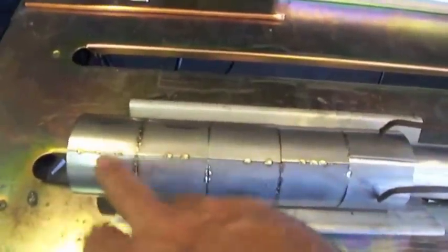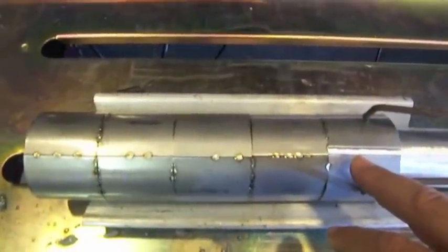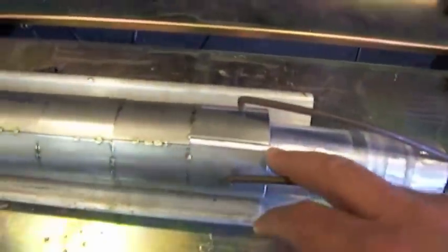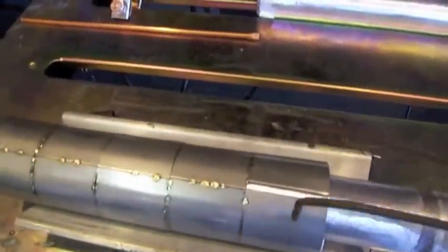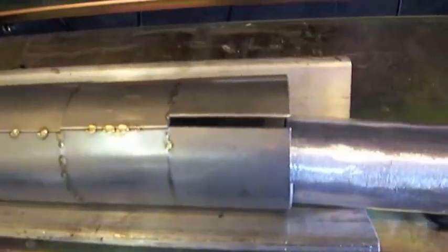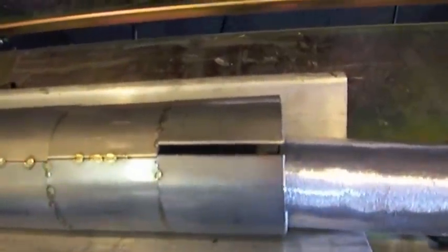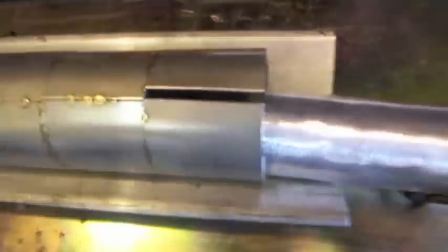How do you deal with a gap like that? Well, using some kind of backup material — copper is the preferred thing, but aluminum is the next best thing. I've got this big piece of heavy-wall aluminum tubing here that I kind of set machines on from time to time, and it'll do the trick. I've just got it slid up in there and it'll provide backing, trap a little argon. A gap that big on 16-gauge stainless steel is not going to look good if you try to weld it without some backing. Even backed up with argon gas, it's going to be tough to fill because it'll just overheat.